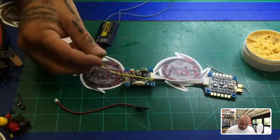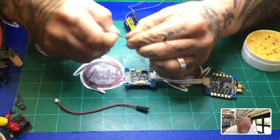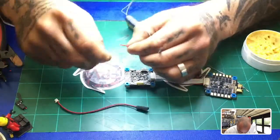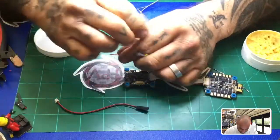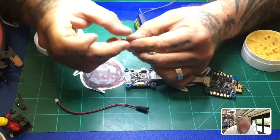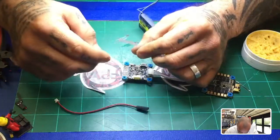And that's going to put paste on here for me. It's going to look kind of nasty. And then what I'm going to do is twist the wire a little bit, and squeeze that paste in there, and that's basically going to get all the paste inside these strands, okay? Now, with that done, you want to look at it, because if you see this black one here, the strands are coming off. You want to make sure all the strands are tight in there.